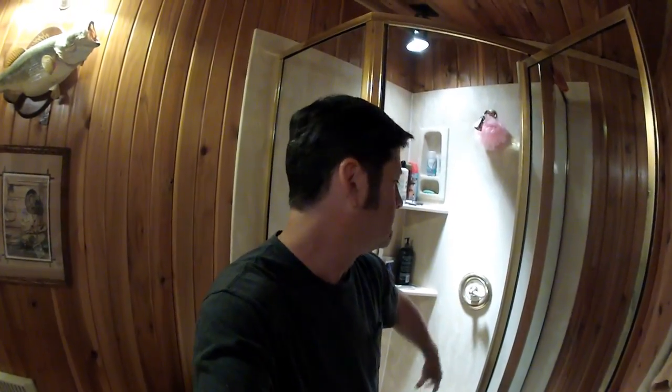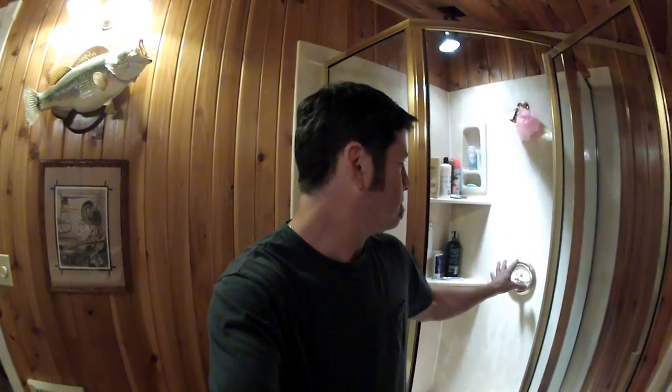When I first put the shower in, I was freaked out because the thing was brand new. I thought I'd have to tear the wall back out, but I called American Standard — they were real nice. The rep asked if I had an older house, and of course I do; this house was built in '49. They told me older houses have uneven pressures and these anti-scald valves don't like that. They sent me a new cartridge, free of charge, but it only helped partway — we still had to jump through hoops. If you got the temperature all the way hot and slowly turned it back to where you liked it, it would stay — as long as no one flushed a toilet or turned a sink on or off.